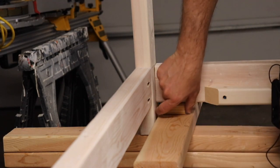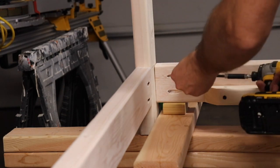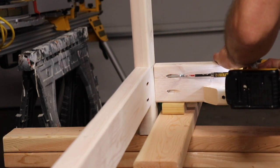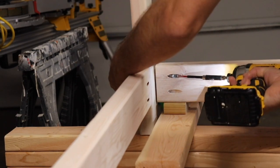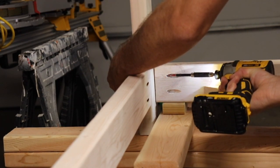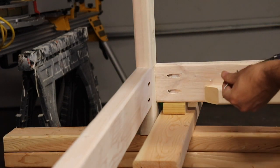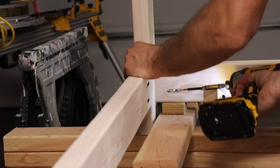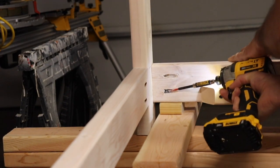Using the pre-cut holes that come assembled in the bed frame kit, one person is fully capable of inserting the frame together, maybe even using some counterweights if it's one individual putting the bed together. Align it up — there's going to be a line at the top of the baseboard so you'll know where to position it so the whole frame is level. Go ahead and insert the screws manually by hand with light pressure, and then use the drill to sink them in all the way to give it a really solid connection with no give in the frame.